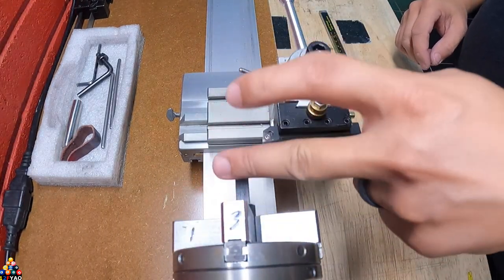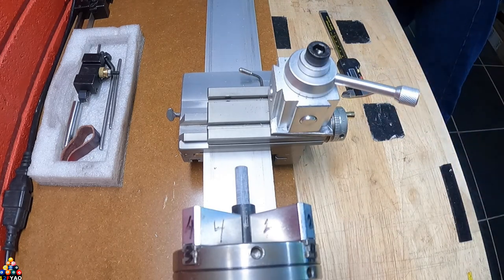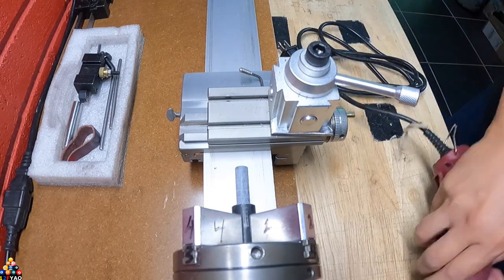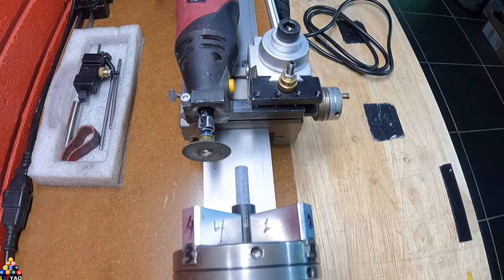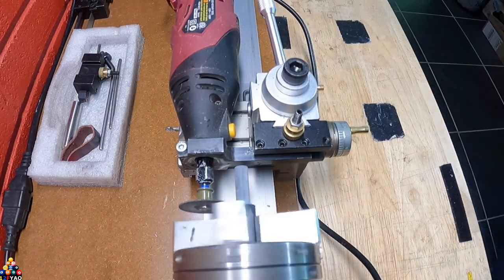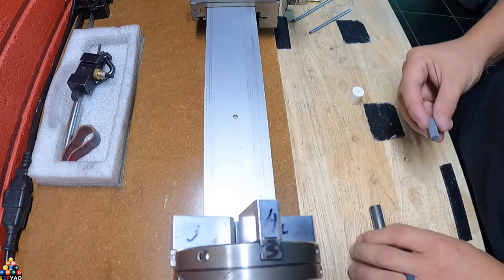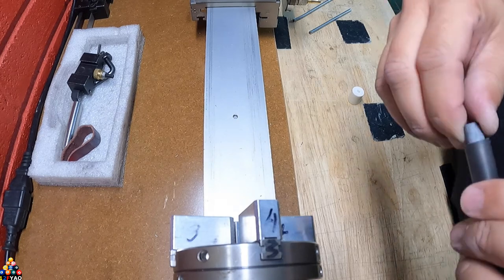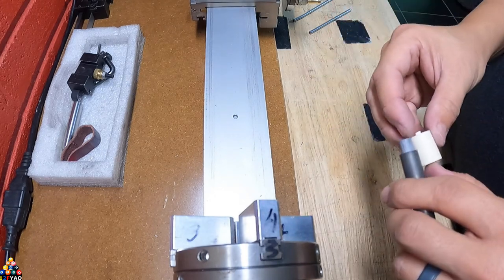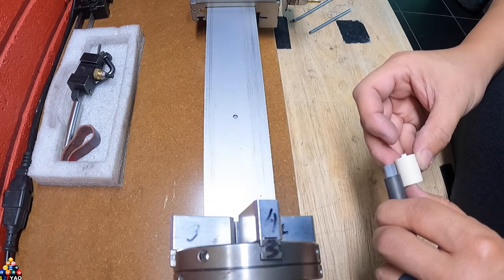Now the tenon fits. Now let's go ahead and cut it off. I find the best way to cut off G10 is with a cutoff wheel. Now I got the G10, you can see how it fits nicely inside the shaft itself. Have the tenon there, and I'll be cutting this to size so that it'll be not flush, a little bit over. And this should make a 29 inch long shaft.